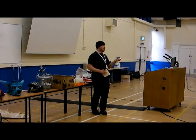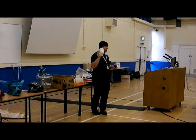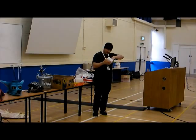The surface of your master transfers to the silicone. So if you want it matte, make it nice and matte. If you want it shiny, make it nice and shiny. Your end result will be the same. So if you look, this mould is actually beautiful and shiny and full of dust, which is a shame. Beautiful, beautiful, shiny.